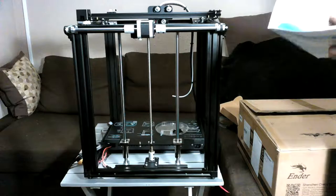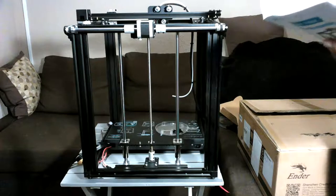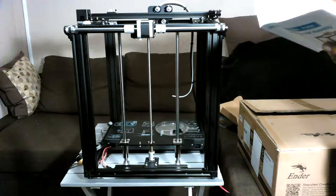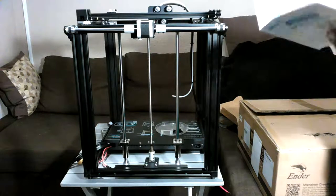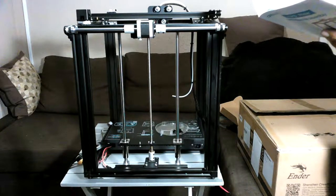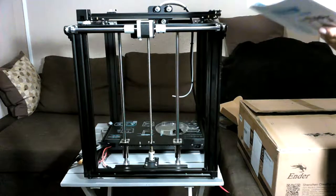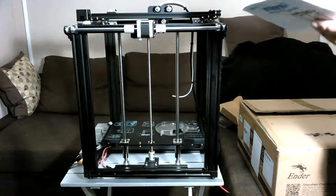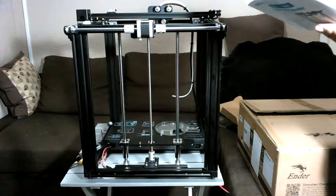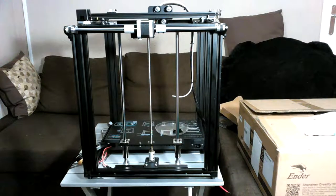Mounting the hotbed, which uses 4 M4 screws. It's a 3mm Allen key. Okay, nothing special here, just make sure it's flat and nice and tight. Before installation, we must check whether the hotbed components are complete, whether the hotbed is flat, and whether the platform plate is tilted. So it's telling you already to check if the bed is flat. So there you go. Let me grab something.